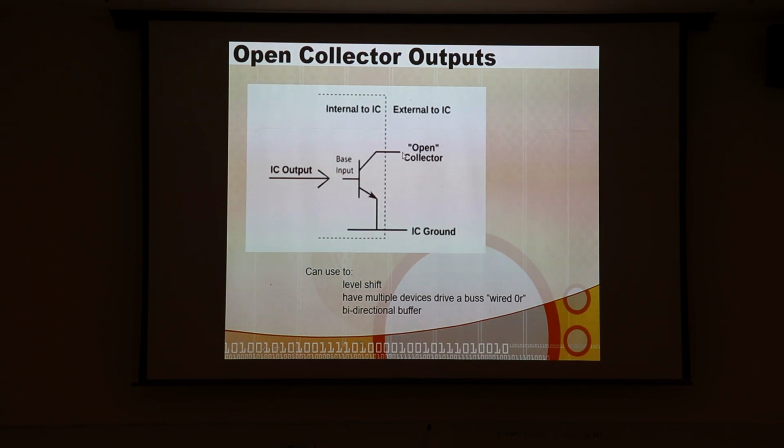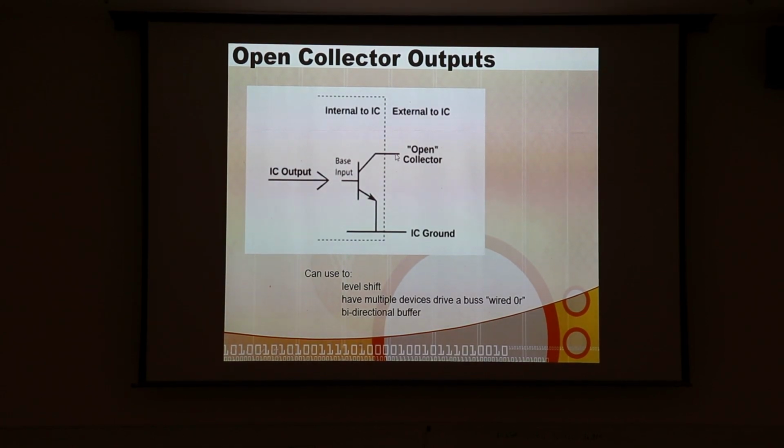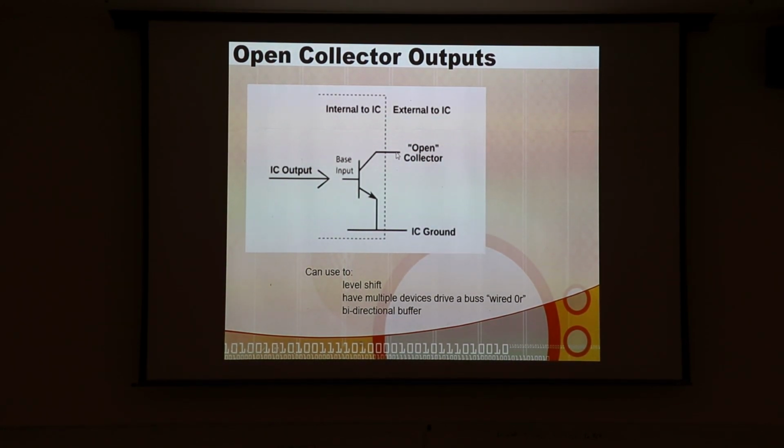And you have to size those resistors so that it pulls up fast enough to support the data rates you want to send. So at 100 kilohertz, you can use a smaller pull-up. You can use one with a smaller resistance, a bigger value resistance. And then when you want to ramp the data rates up, you have to decrease the resistance a little bit so that it pulls up faster, because there's always some parasitic capacitance on these runs.